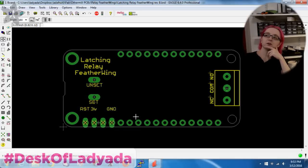Another thing that's interesting is, I was thinking, why not just have buttons for the relay? One of the things is that every one of our testers acts the same. You put the board on and hit the reset button and it lights up green and beeps. We have 250 products, and what's the value in having all the testers be consistent? Once in a while we have a tester that's not that way, and it actually has caused issues.